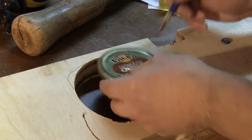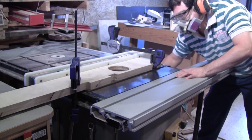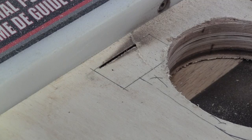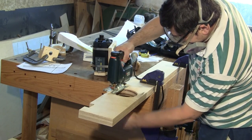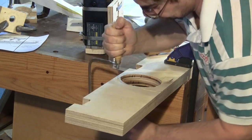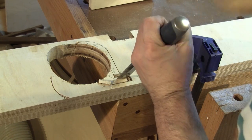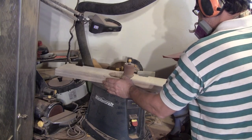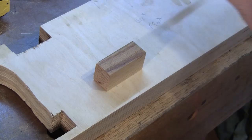I also trace a new form for the motor's hole. This cut must be straight, so I clamped the front on my table saw and with my thinnest blade I cut the bottom of the motor pivot block by raising the saw blade. It's not that bad — I'm satisfied with it. For the rest of the cuts I try to use my jigsaw, and here you can see why I never use this tool. I finish the cuts with a coping saw, chisels, and a flush trim saw. The rest is done with the sander. The last thing I do for the motor mount is to drill the pivot hole on the two pivot blocks.